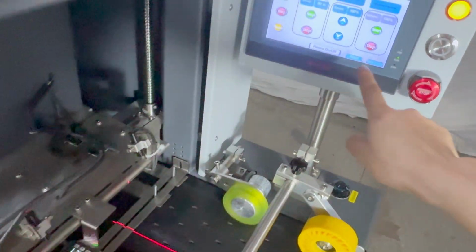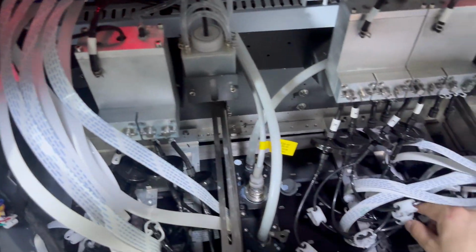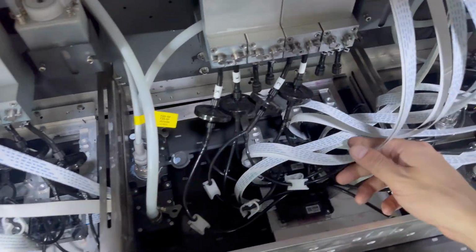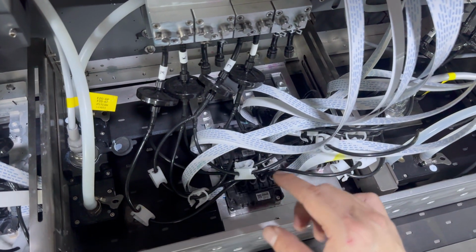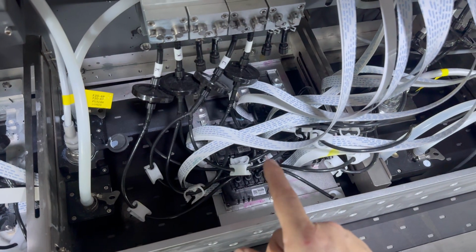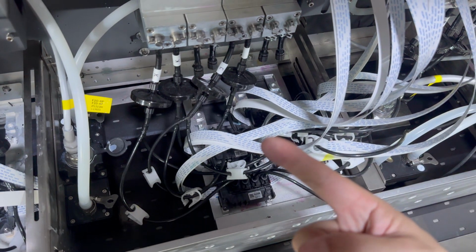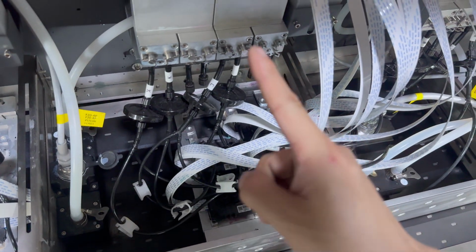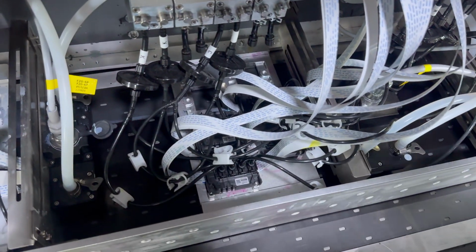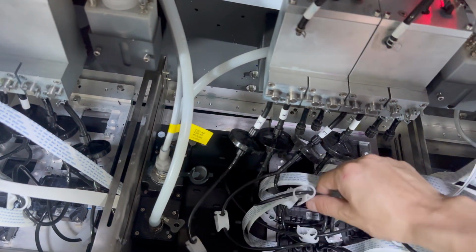Then we first stop the belt. And we go to the print head position. We can see here we find some problem, the missing channel. There are two solutions. First, maybe the print head is clogged. Number 2, maybe the ink channel is not going through, it's closed. So we check the first print head, the second print head, whether it is closed or not.